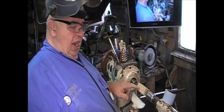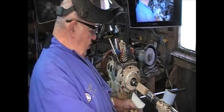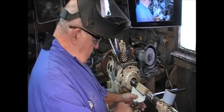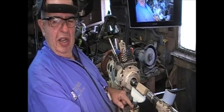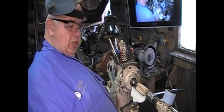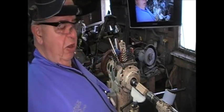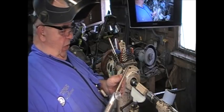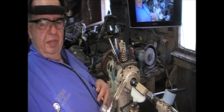I'm going to shape this down using my roughing gouge and then my skew. Again, to raise it, I'm going to my reference mark on my tool rest down here that tells me that it's about my average height. I'll do a test spin to make sure it was spinning right. And for this, I'm going to start with my 3/4 inch D-Way Tools roughing tool.